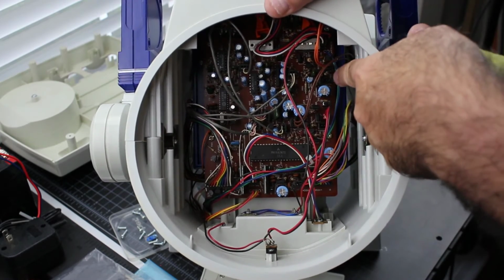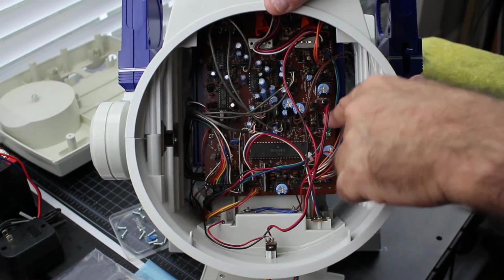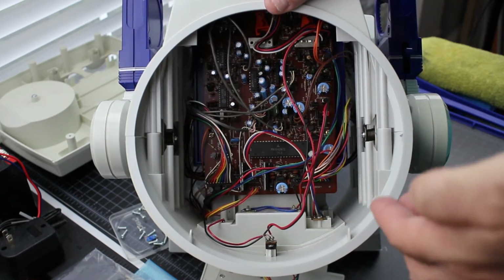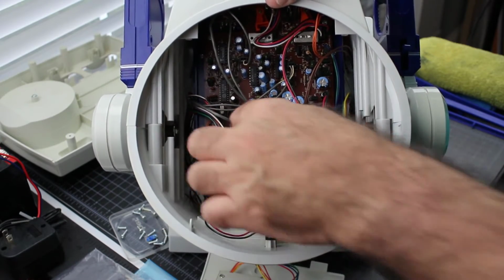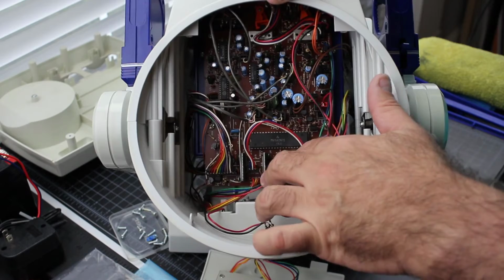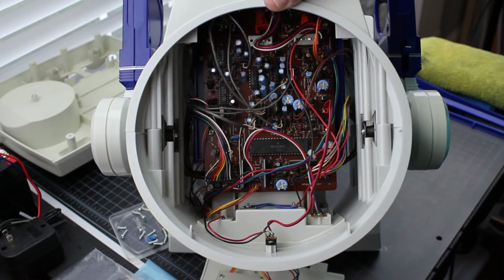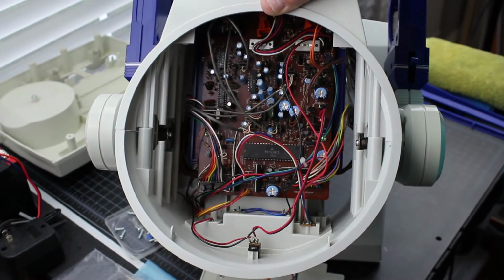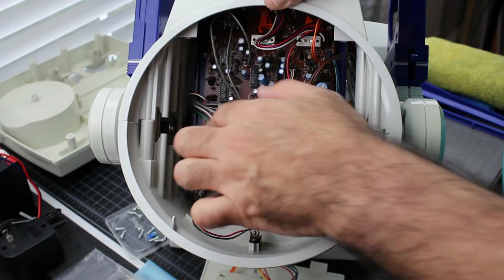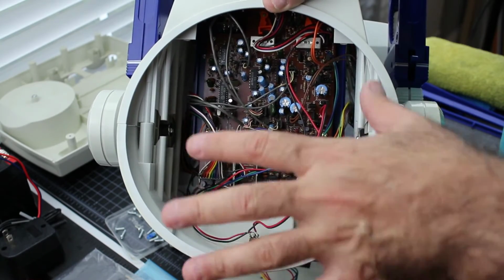Just above the microphone here, that empty one, that's going to be the yellow plug from the headset. And then just below the red here, there's an open socket there. That is going to be the green from the headset. Okay, so that's really basically all the stuff that we had unplugged. And then the adjustment here goes just above the motor. There's a plug there. So basically, you're going to use up every plug in here. You just take a quick scan of everything, and if there's any open plugs, there's some wires missing somewhere that you need to plug in. But hopefully you can take a quick snapshot of this, or I can also post a snapshot of this. But that's the wiring, and that's for the Hearoid.